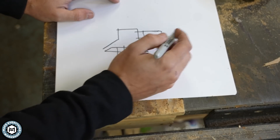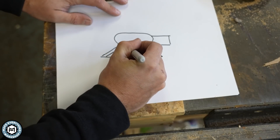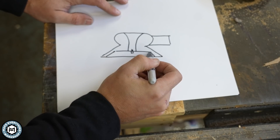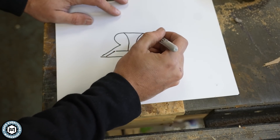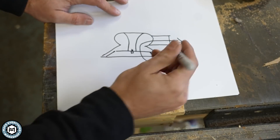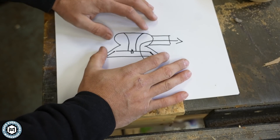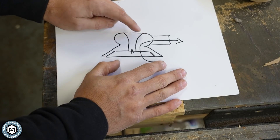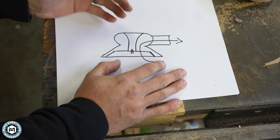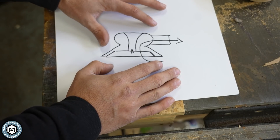Moving through an iteration of this, I was able to come up with a design. Essentially what we've got here is a central stem that would hold a screw, the sanding pad would exist there, and then you've got this whole chamber that would all be contoured and allow airflow to come in through the bottom and then go out to my dust extractor. All that dust would be able to get sucked up through the holes and go out the side. To manufacture something like this traditionally would be really difficult — I could try to turn it out of wood on the lathe, but it would be really hard with all those different directions, and you'd have undercuts and have to glue in a port on the side. While possible, it wouldn't be ideal.